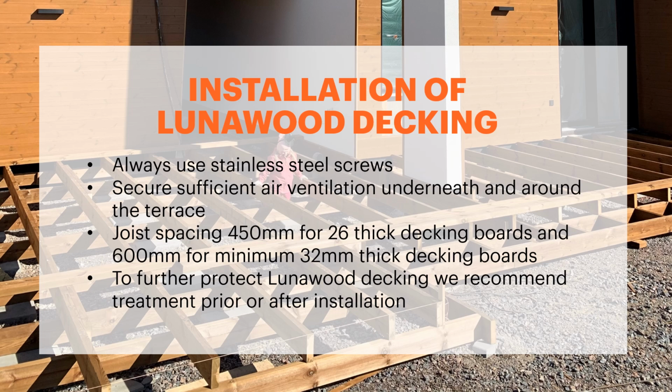Now we are going to talk more about how to install and maintain Lunawood decking. We always recommend using stainless steel screws in order to have longer lifetime and no appearance of rust. Lunawood materials may not be in direct contact with the ground or in a permanently wetted situation. The understructure, a subframe, should be made from suitable material with the necessary durability.